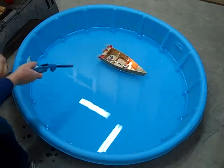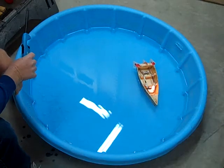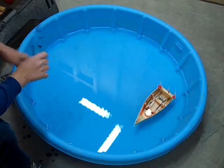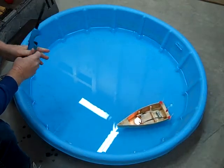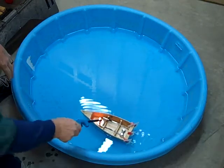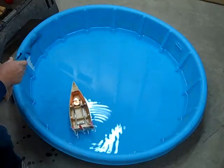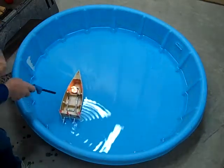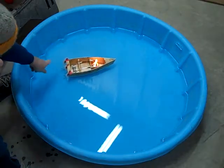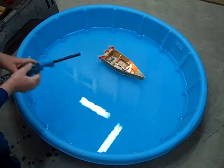What's in the boat is an oil-fired kerosene lantern style heater that I built out of empty aluminum tins from tea candles. I made my own wick. This is an aluminum heating coil that I made. There's also a bolt in the boat for dead weight, so the thrust ports stay submerged. If they suck air, the boat stops moving.